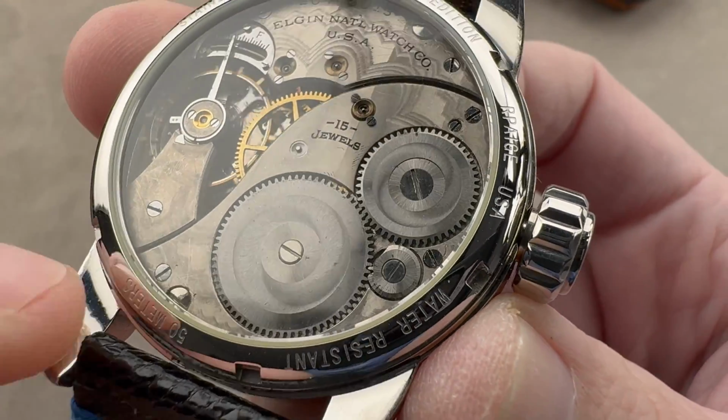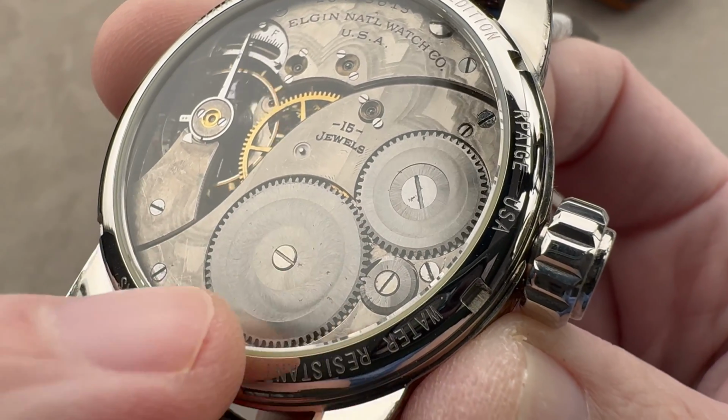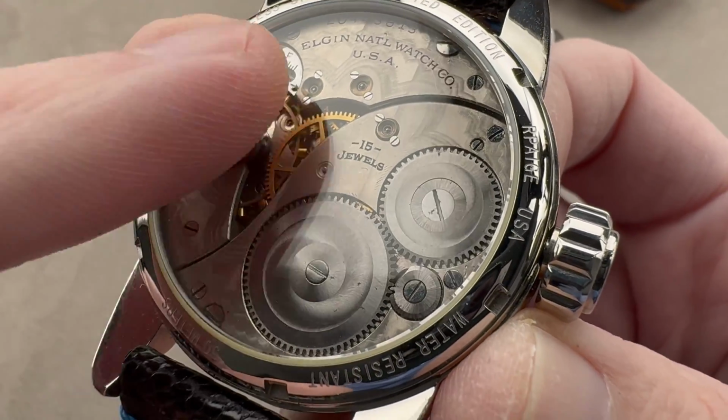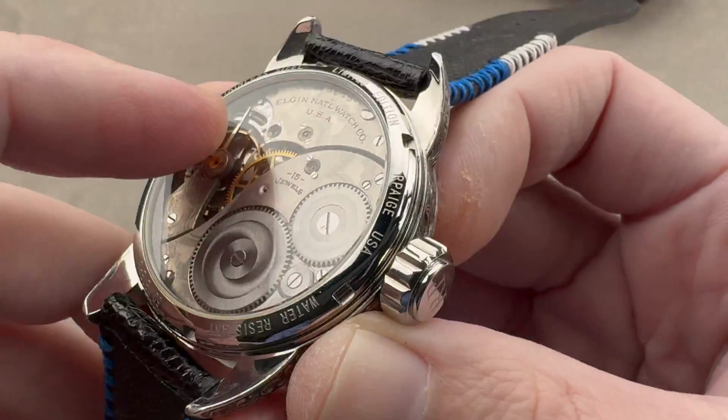I might have repolished the screws with a zinc plate or lapping paper and reslotted them with a triangular ruby file, but I do respect Richard's decision to leave all of the scars and marks of wear on the movement and its parts. That sort of preserves its history and its story.